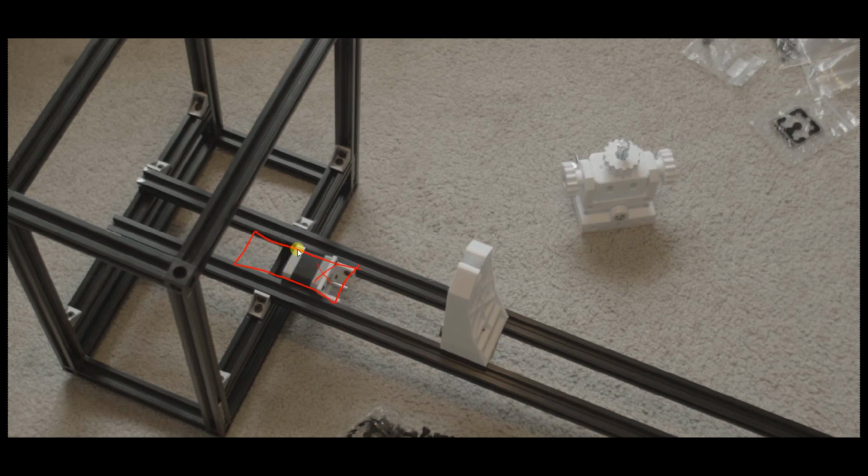And you are going to set these screws here. Go ahead and snug them up with the gantry plate touching both rails. So you're going to hold the rails together with your hand pretty firmly. Tighten these up, but do not tighten these bottom ones yet. Leave these loose or semi-loose. So now that you have these clamped with the plate in between and there's no slop, make sure there's no play. If you have the gantry wobbling around, they're not snug enough. So make sure the gantry can't wobble in this position.